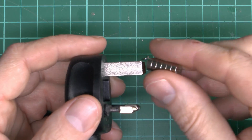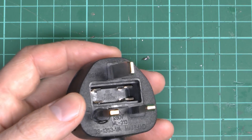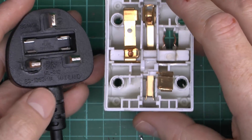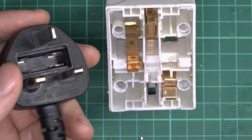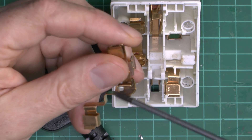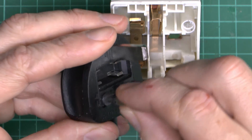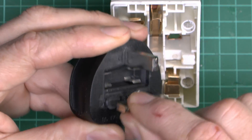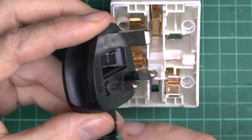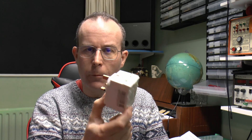The plug has shiny silver pins, also not attracted to the magnets, though that doesn't confirm a great deal. In terms of manufacturing to whatever requirements are needed, they're probably both made to a reasonable standard. What's happened here is either this contact has worn from having a high load on it all the time, and it only takes a little bit of overheating to soften the metal, or the pin itself has overheated and come loose inside. If that is loose and there's wobble involved, any heat formed will conduct through the pin and melt the insulation, damaging the socket as well.